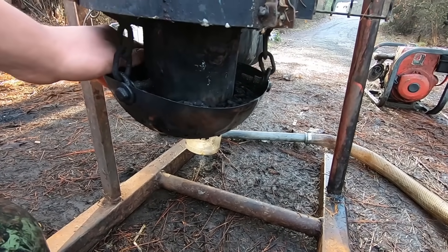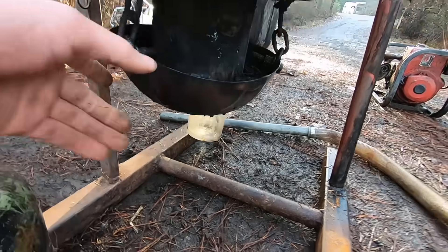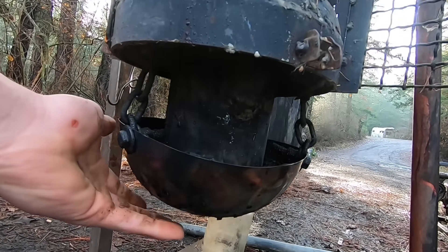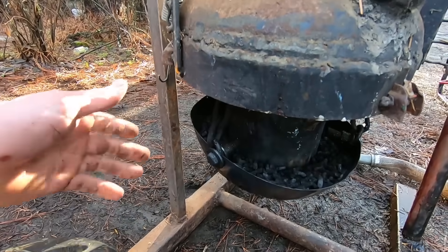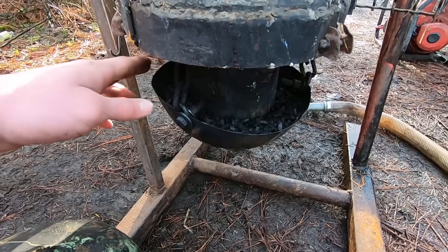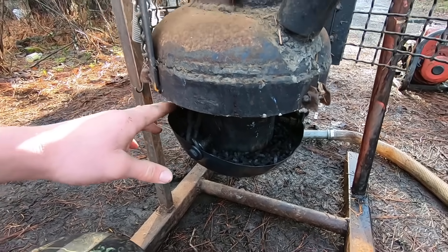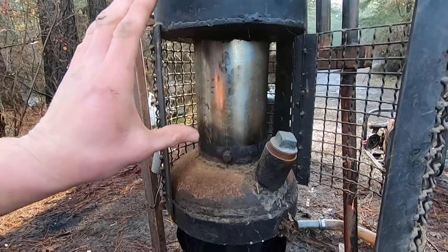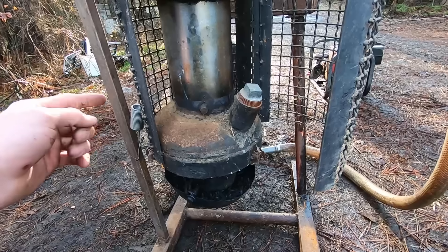This piece is really where all the magic happens. This is called the burn bowl or shaker grate, and in my case it's just a stainless steel bowl with holes drilled in the bottom for ventilation. Not just the surface pellets are reacting — we're getting more gas and a more efficient process. This is called the fire tube, and the diameter and length of this is important in calculating how much gas we'll be able to produce and thus how big of an engine you'll be able to run.